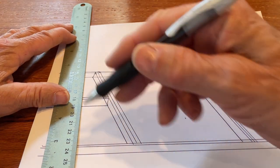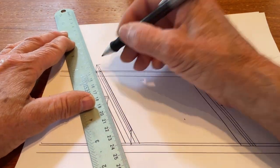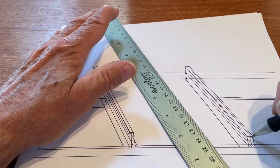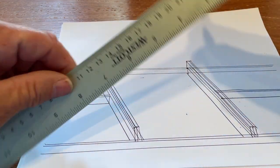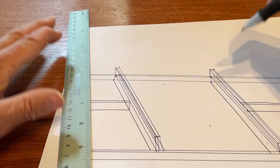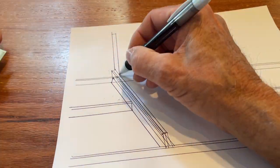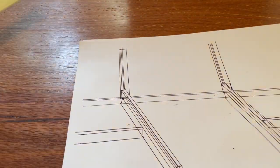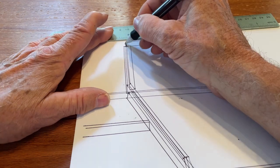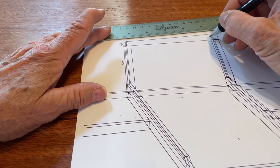Here's an illustrated overview of how I built the attic frame. Once the hole was cut and the headers were built in, I put a double 2x8 glued and screwed together, spanning both outside ceiling joists — hanging over just a little bit more than the joist width to give it support. On top of those double 2x8s I put triple 2x6s as columns rising up for the hoist, and then a triple 2x6 across as the beam that holds the hoist — all bolted in.